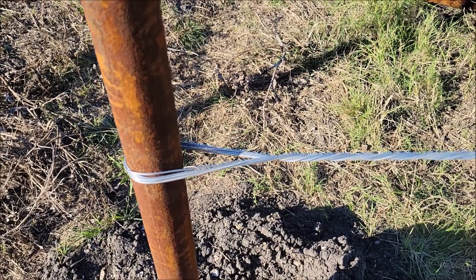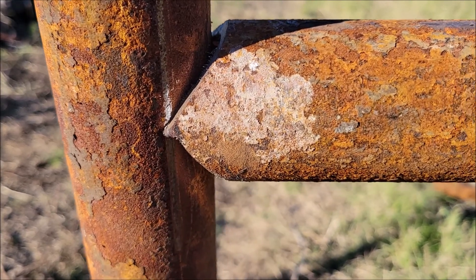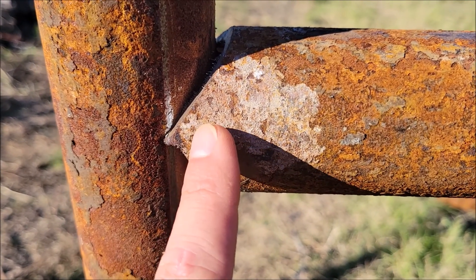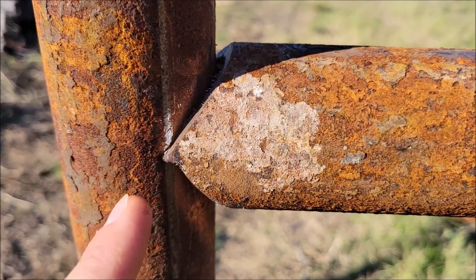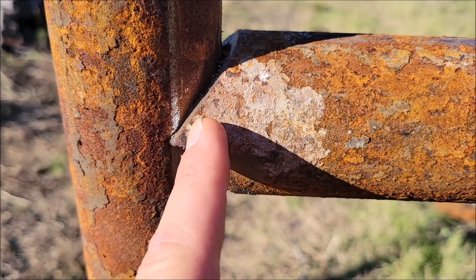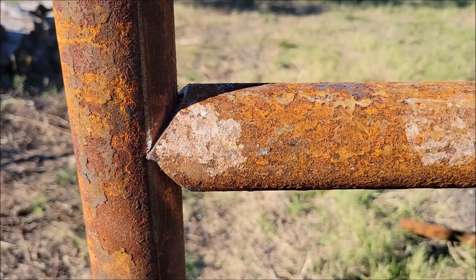What I do is always put a bind like this on my corners — wire holds them in and keeps them in a good place for me to weld. When I do that I can tighten it up a little more and it will actually flare these edges out. For this one, since the saddle is not a perfect cut, I also have this little bit here so I can just nip this little edge off and it'll probably saddle just fine.